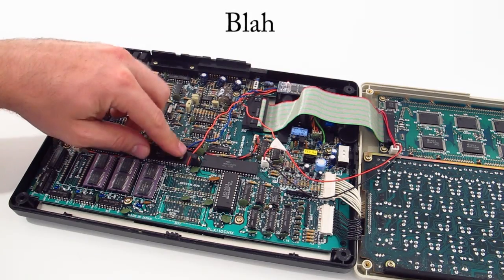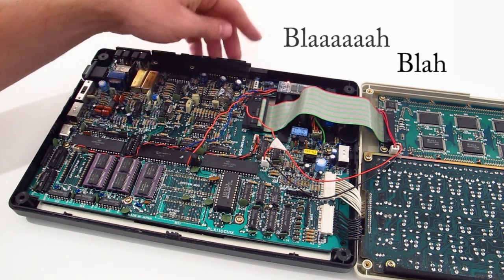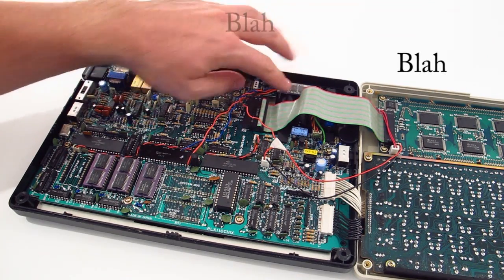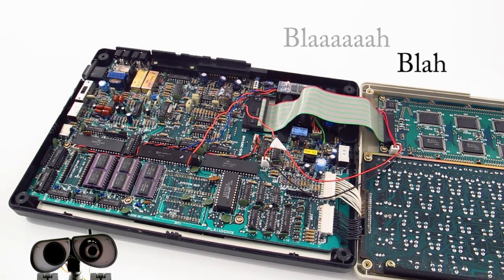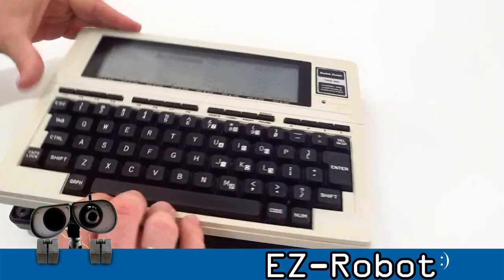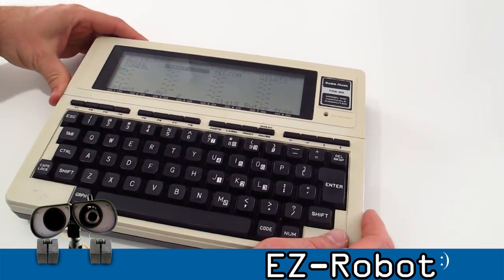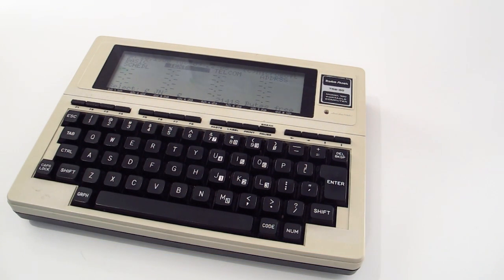The TTL is inverted for RS-232 compatibility on a PC out of the output here, but because we're intercepting the TTL, we can connect it directly to the Bluetooth module. So now we can connect EasyBuilder — or at least the EasySDK — to this Model 100. We're going to have 1983 technology control a 2012 technology robot.